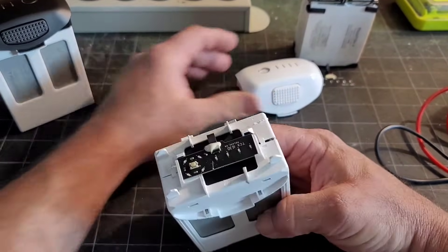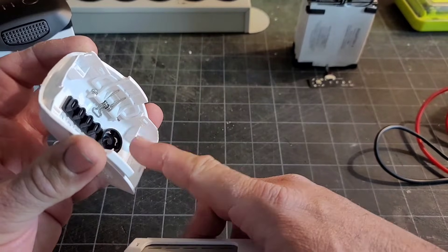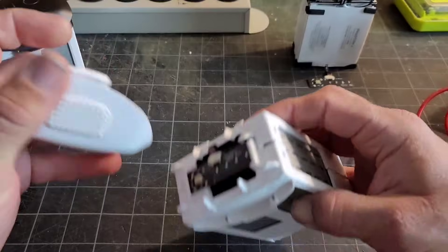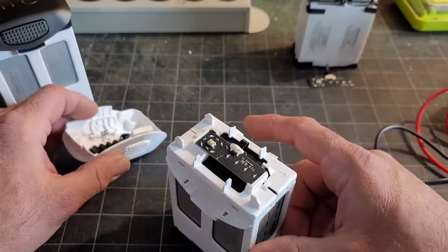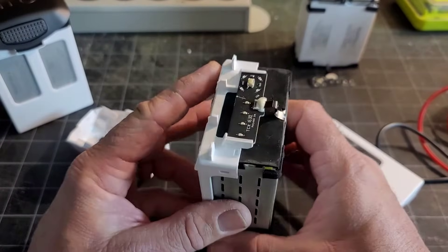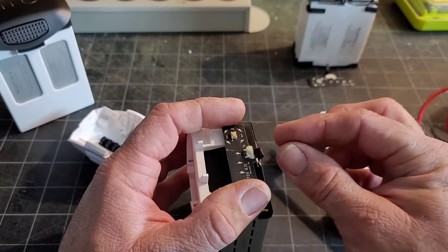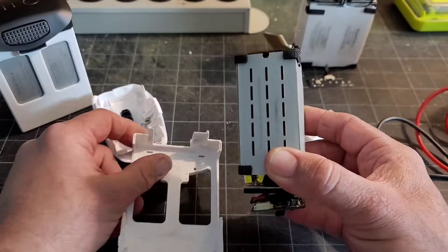With the cases, these ones are more difficult to get off. You can get a screwdriver between here to lift up and get these little pins out of the slots. The problem with these ones is if they do not have the screw here, they're actually glued — there's a drop of glue on each one of these, and the fourth one broke off. Once that comes off, you can work getting the case off. With the board, you can gently work it out if it's sticking. There's a ribbon cable that comes up here — you push the lever up, the cable slides in and out of the slot, then push the tab down and it locks in. I repositioned it in the slot and it works better now.